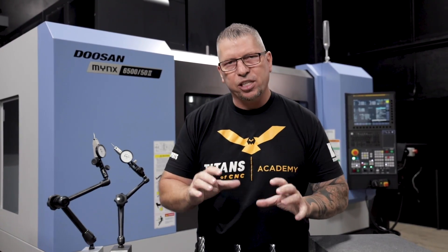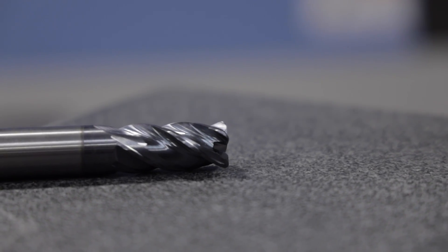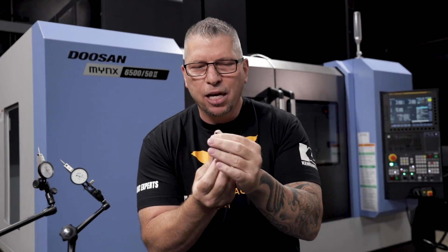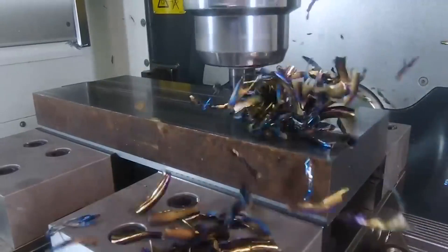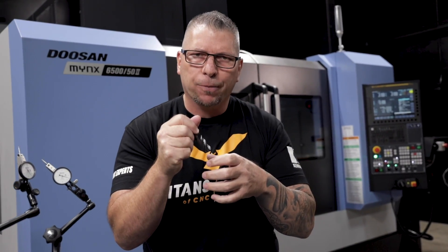Let me explain it a little bit deeper and actually look at these tools. You got a million tools — I got three right here. First is the Harvey 1TE. It's a four-flute, it's made for slotting, steels, and hard materials — like titanium, Inconel, Monel, literally anything hard, this is your guy. Now, it has four flutes, therefore we're slotting. The genius in this geometry is that this tool can actually ramp in titanium down at 45 degrees. So when I'm side milling and I'm in tight spaces, I can just drop this in and get after it.